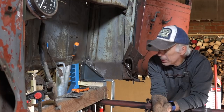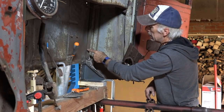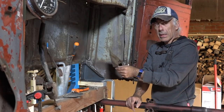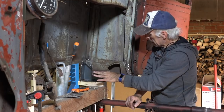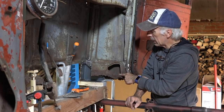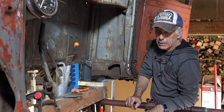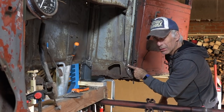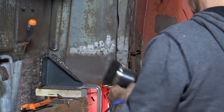We've got the bracket welded in place — it's all set and done, looks pretty good and solid. We also did the reinforcement here and extended the little bend, so that looks good. The spot welds are good. This little piece here is next — I'm not going to paint it yet. I'm going to go for a flat plate using a bit thicker steel. All these screws are really rusted away so I'll have to drill them out, then quickly sandblast it a bit so we can weld on it.